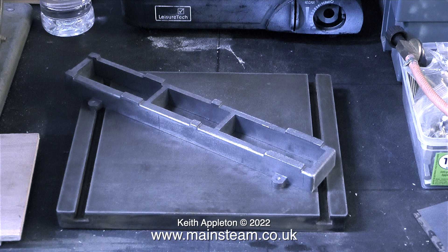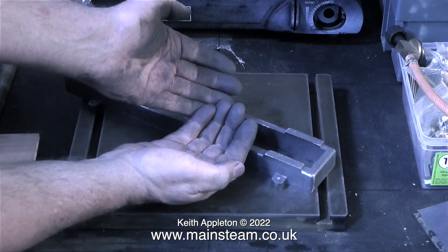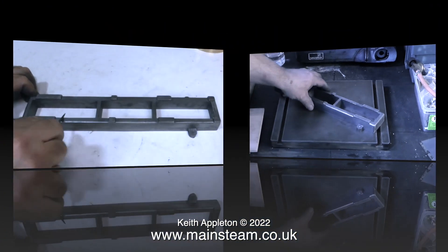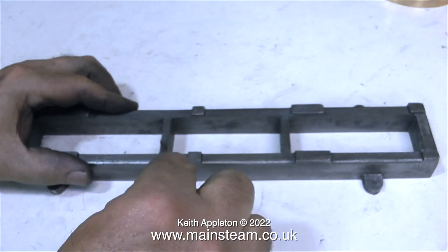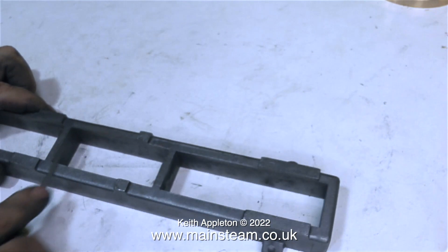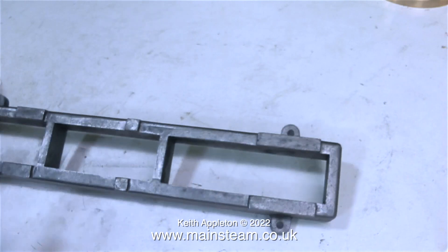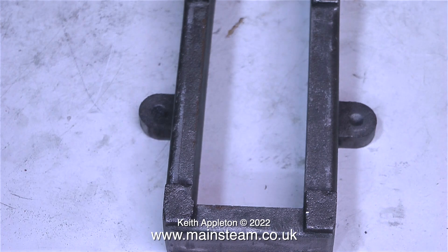Alternatively, you could get hold of a piece of plate glass — that's also flat. I think it's time I wash my hands; working with cast iron is a very dirty job, but I like getting dirty sometimes. Back to the filing — this time it's on the bench and I'm using a very fine needle file. All I'm doing with the needle file is removing any sharp edges. While the casting is on the bench, I'm having a quick look at it.